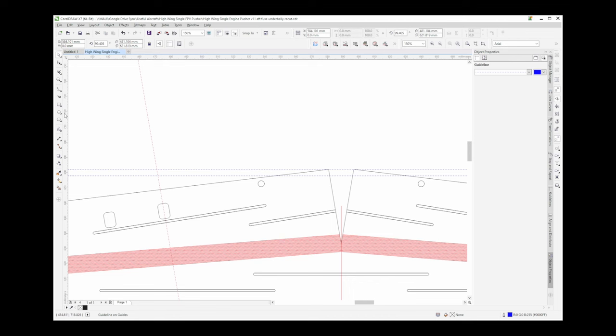a 3.5 millimeter cut. That cut is actually going to be a box. It is going to be symmetrical, and it's going to be 7 millimeters. The reason being is that it's got to cut 3.5 millimeters either side. So the width of my hardpoints, 5 millimeters. Not that I just didn't measure that. So we'll set this to 5 millimeters. And I'm going to go for 8 millimeters to accommodate for some shrinkage.